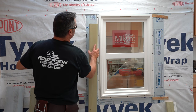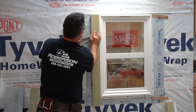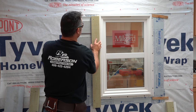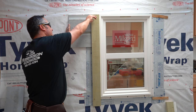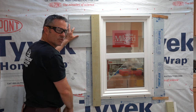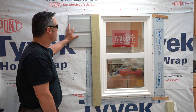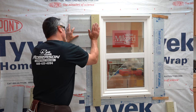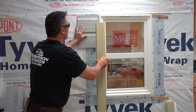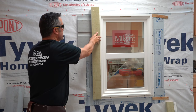The other way of doing it would be to trim this out first and then put the siding up against the 2x4, then slide it together. I like this look — it looks very tight. However, you do have wood butting against wood where water can get in if it's not sealed right, and it could cause rot over time. The 2x4 is a lot thicker than the 1x4 and may not bow, but this application is probably the better one.